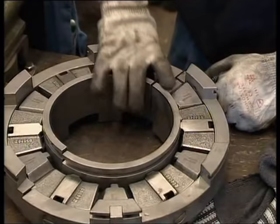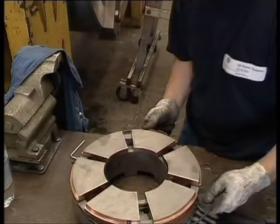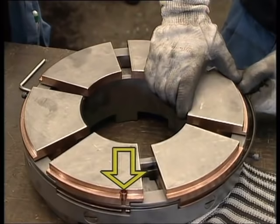This is the compressor thrust bearing. Here it is shown in its housing. These are the tilting pads of the bearing. Some of these hold the thermocouple heads. The filament is lodged in a slot made in the body of the bearing.